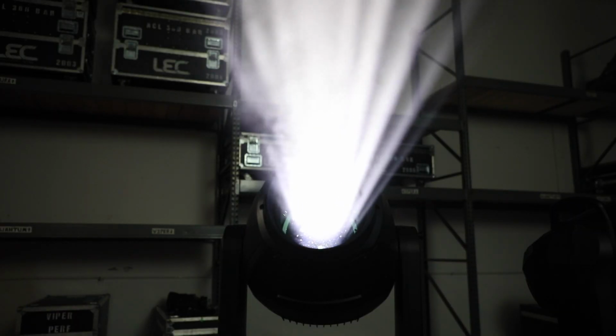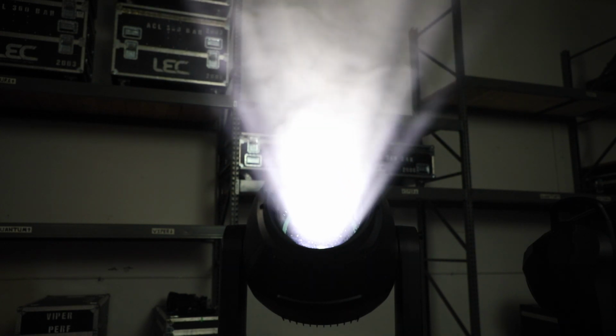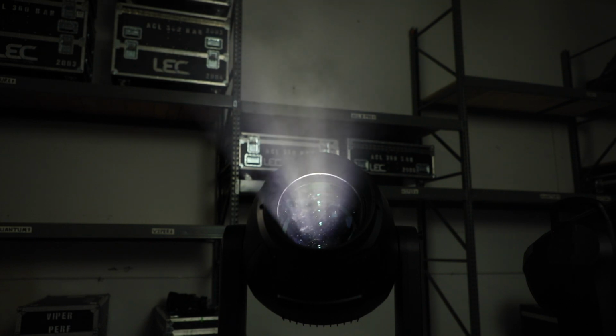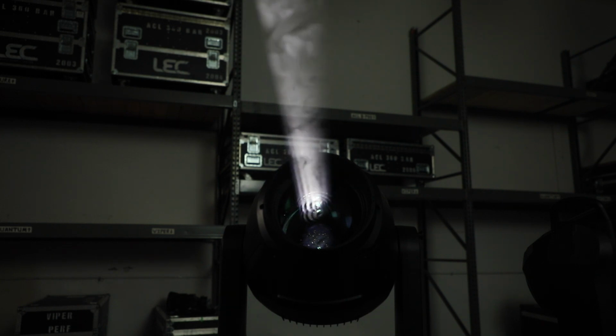would be gobo morphing, because I want to see how the Perseo does a gobo morph, actually. That's a really interesting question, because all those focal planes are really hard to calculate all of the sharpness when you're trying to do like a frame and a sharp gobo and then maybe morph to a soft gobo. There's a lot of really hard things that were easy to do with point source lamps that were different with LEDs, and I feel like this iteration of fixture now has all of that optical math understood better than we did a few years ago.